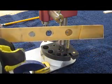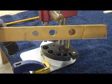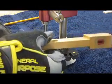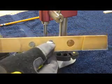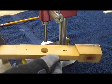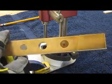And then simply insert the poplar wood plugs that come from Pianotech in there. They'll be a little too wide this way. So glue it in so it's flush on one side. And then the other side you have to trim off with chisels and some careful work at a sander. But that's for another video.